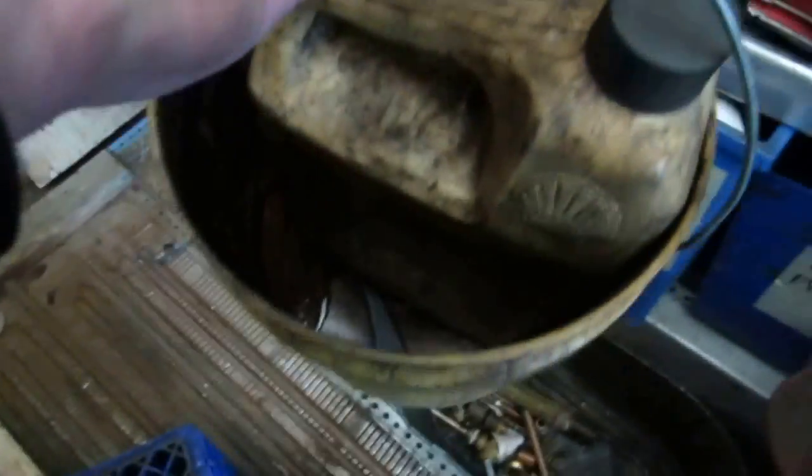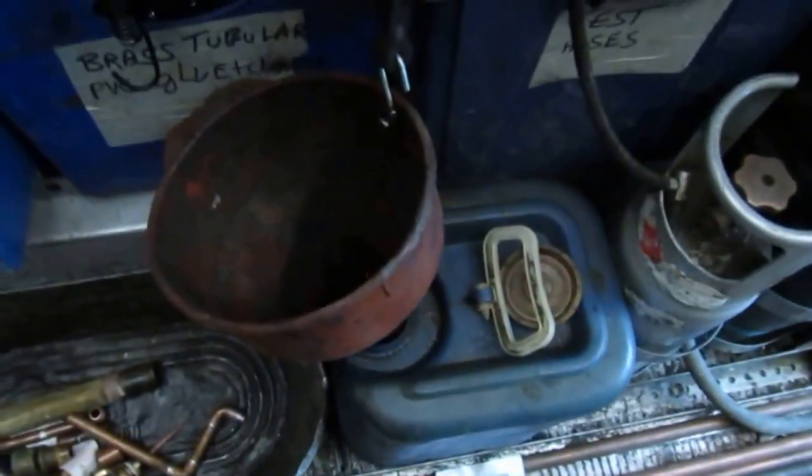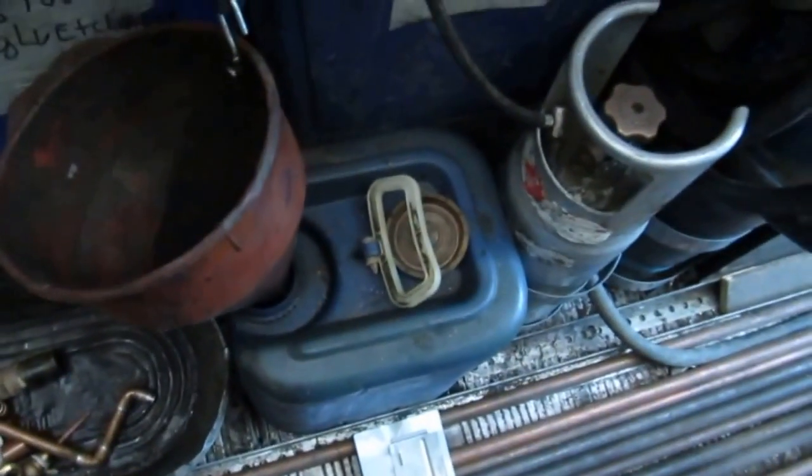I got my vacuum — my soot vac for the boilers. My little trusty oil container I bring in every time I do an oil burner service call. I drain the oil into this little flat container, clean out the filters, and when I come back to the truck it goes in this container. All the oil drains down to the bottom.